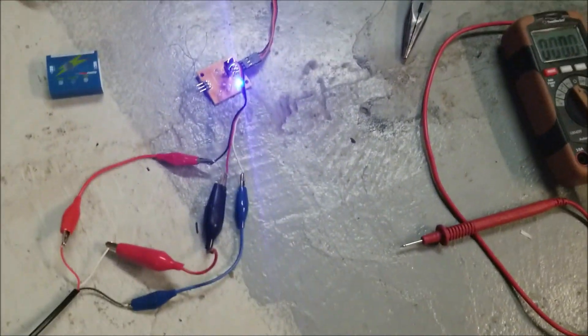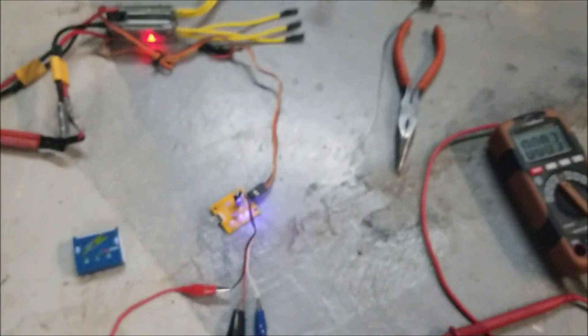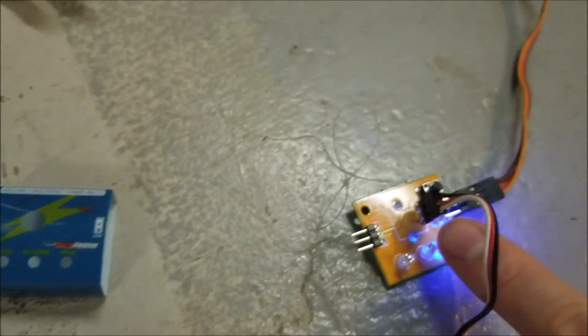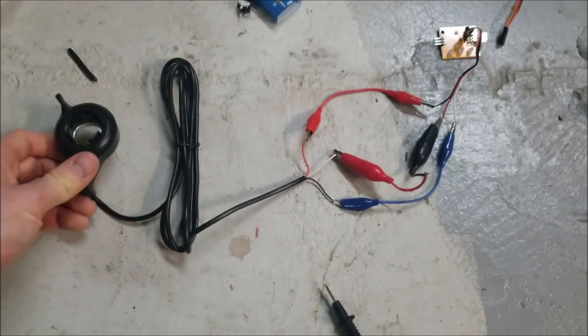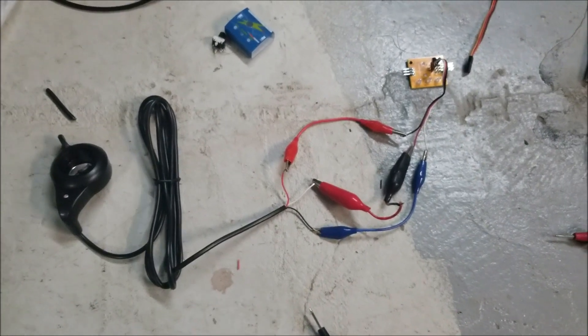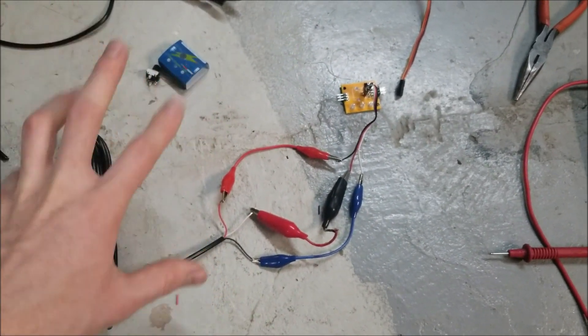I have successfully connected the thumb throttle to my motors. What I did was take one of these servo testers, which converts an analog potentiometer signal to a digital PWM signal for the ESCs to interpret. You remove the potentiometer off the servo tester, then take the wires where the potentiometer hooked up and plug in the wires from the throttle — power and ground to power and ground, and the signal wire from the throttle goes where the signal pin from the potentiometer was. Make sure you get the polarity right because I already fried one of these — I reversed the polarity and tried all the combinations.